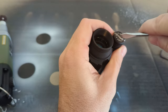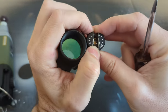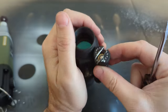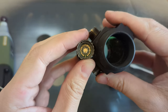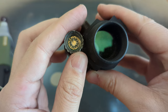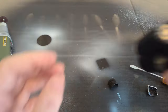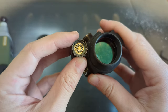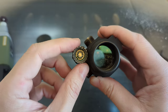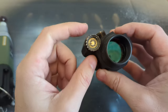Let's see if we can open this thing up. There we go — in here it looks like the brightness adjustment. There's the brightness adjustment knob and it looks like we've got a bunch of resistors there. As you turn that knob, it's making contact — as you rotate the knob, it's just got increasing resistance. This is connected in with the circuit that feeds the LED — probably the drop resistors for the LED. As you increase the resistance, the LED brightness drops because it doesn't allow as much current.